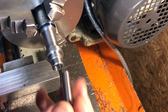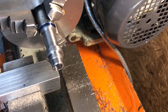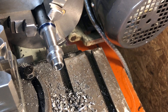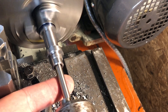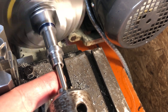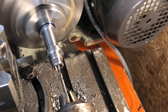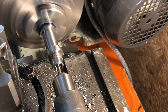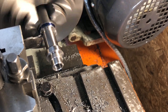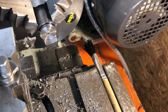That is the main bore complete, and I am pleased with the fit I have on my silver steel stock. I can then move on to the through hole for the plunger stem. After checking that the bottom of the bore is flat, the centre is re-established with an extended centre drill, and a light touch of the finger allows me to detect any vibration that would indicate wandering of the tip. With that done I can drill past the end of the part, again checking for vibration with a finger, and finally ream to 1/8th. A light countersink to break the edge completes the work, and I can part it off. This can now be put to one side awaiting milling, and I can make a start on the plunger itself.